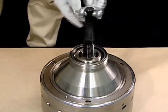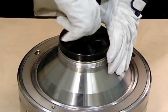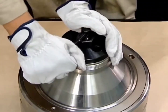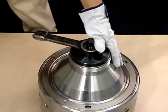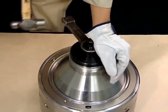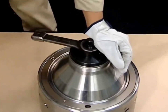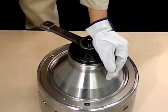After setting the bowl, remove the bowl lifting jack and set the disc clamp plate. Screw the push bolts of the disc clamp plate into the guide tubes and firmly tighten the hexagonal nuts with the hammer. This procedure is important. Its purpose is to dampen the springing effect in the disc mounted on the bowl to protect the thread of the bowl nuts and make it easier to release the bowl nut.